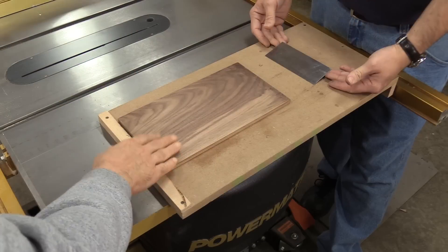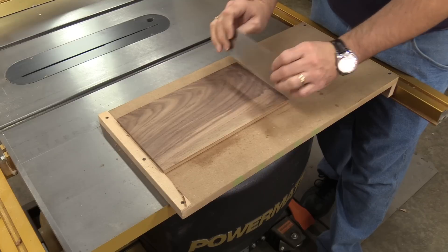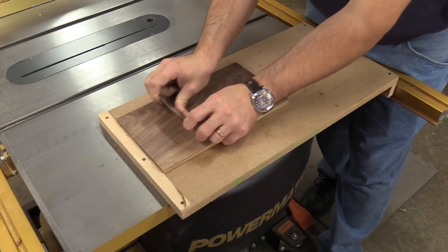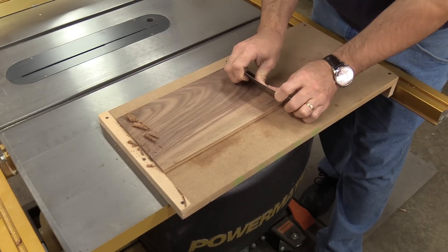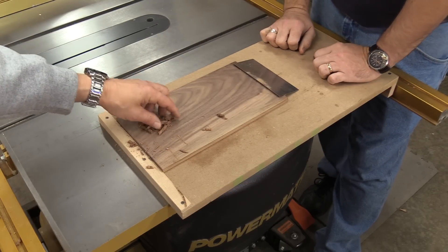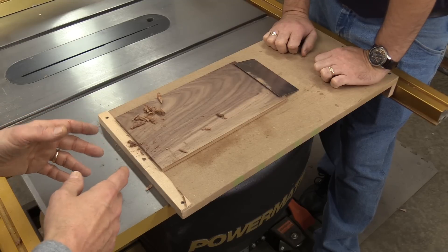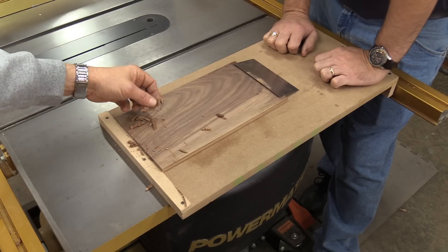Put a walnut board here on my planing stop. Why don't you give that a try, Mike, and let's see how we did. To use these, just press it in the center and move it forward, adjusting the angle to find that sweet spot where the edge is. There you go — nice! These little curls are what we're looking for. If you just get sawdust, that means you don't have the angle right or you didn't draw enough steel out. You've got four edges on there, and sometimes you get three good edges, sometimes all four — it doesn't really matter, but that's real nice.